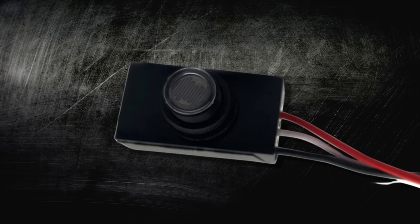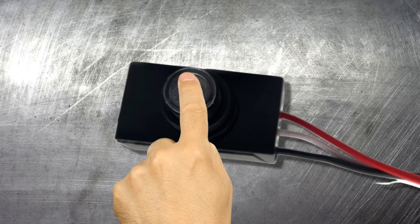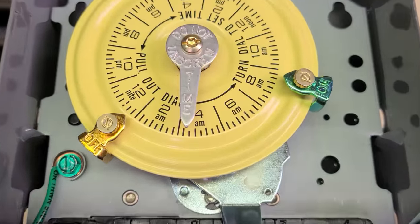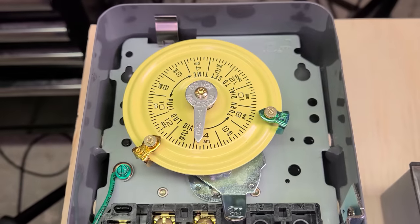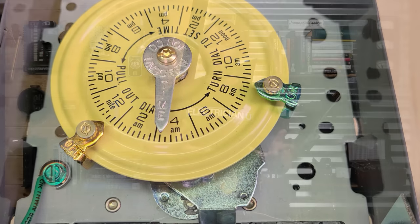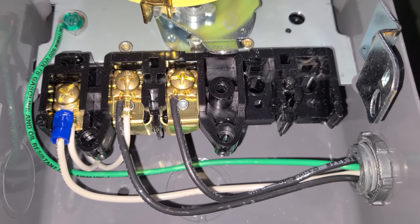This style gives you the option of having some movement. Sometimes when you're pointing these things it's hard to figure out where the sun's going to be, and if it's behind a building it might be dark for a long time, so a knuckle style gives you more controllability. Then there are button styles, which are really easy to use for demonstration purposes — you just put your finger over it and the light almost immediately comes on. Next, we have time clocks. They generally work off an analog clock system, running a 120-volt circuit to power the clock and make it spin constantly. They have trippers — you might put one on and one off, or an on and off for morning and an on and off for evening.